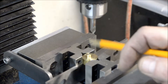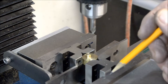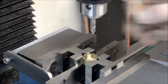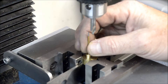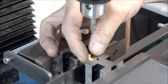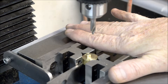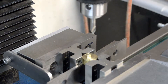I parted off the piece and left some extra so I could hold it in the V-blocks here. I took my sixteenth-of-an-inch drill bit and chucked it up in the chuck as a pilot. I swung this back and forth until I got the high spot with a dial indicator, then locked it down with the V-blocks. I moved the table back 250 thousandths. Now I'm gonna center drill and drill with a nine-sixty-fourths drill bit.